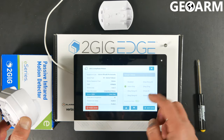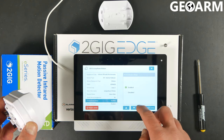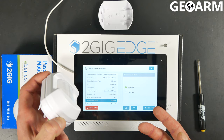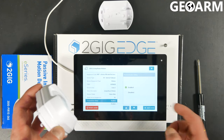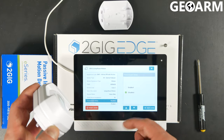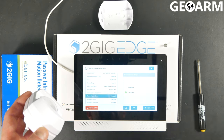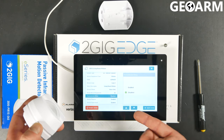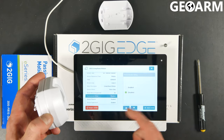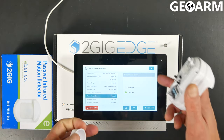Hit the down arrow. This is smart area assignment — I'm just going to leave it in area one. Transmission delay is where it gives an additional delay until it transmits to the central station when triggered. I disable that because I want it to immediately go to the central — I don't want there to be a delay for that signal. Sensor reports should be enabled unless you don't want the sensor to report. Sensor supervised — you want to go enabled. At that point you have configured the zone.